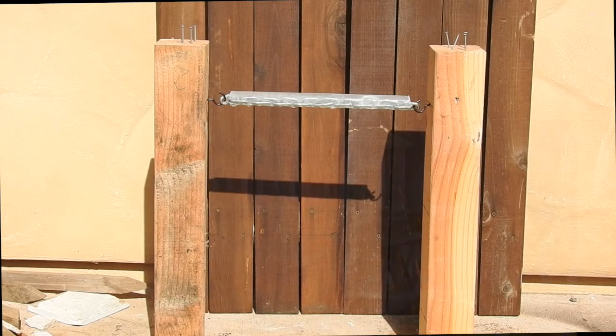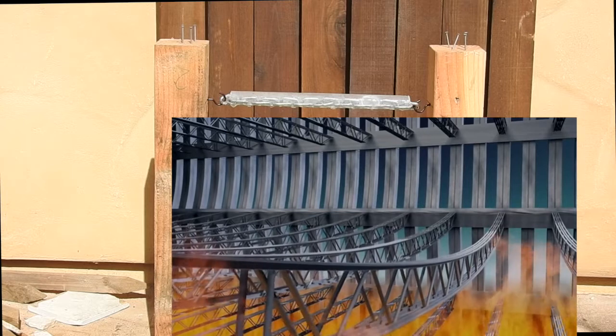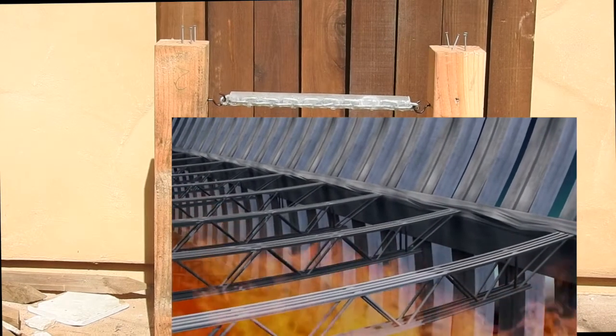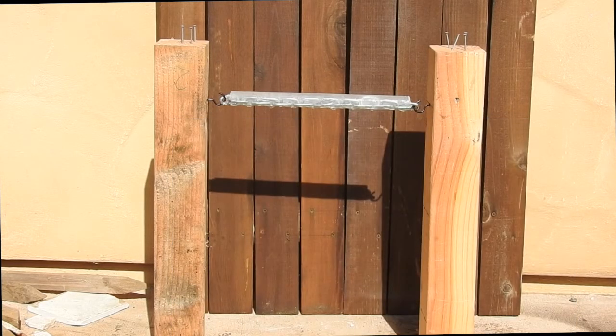What I'm trying to do is replicate something like the buckling of the trusses in the World Trade Center. The floor trusses were heated from below, they sagged down as they lost their structural strength, and they pulled in the exterior wall of the World Trade Center, which in part led to the eventual collapse.